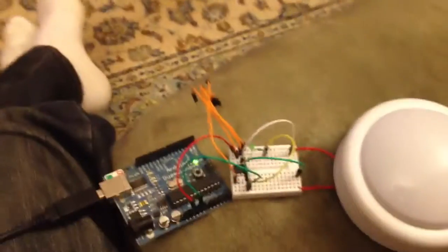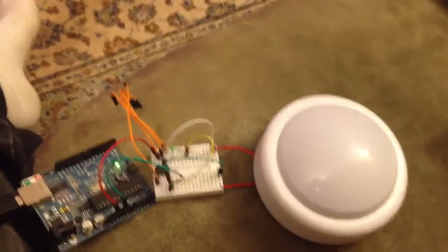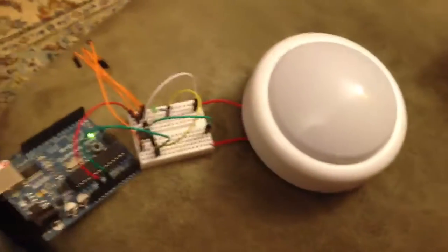And that's about it. All I really have to do left is the interesting part, which is that the doorbell is in the kitchen over that way. So I'm going to have to get power to it to begin with. I'll need a 5-volt regulator, get it down in there, and have it going outside and caulk all around it so it's nice and weather resistant, but then also running the low voltage up and over to the doorbell.